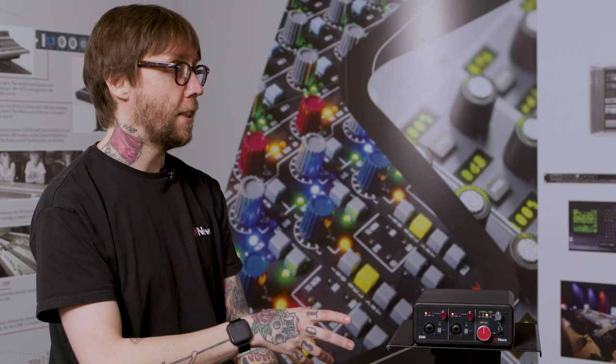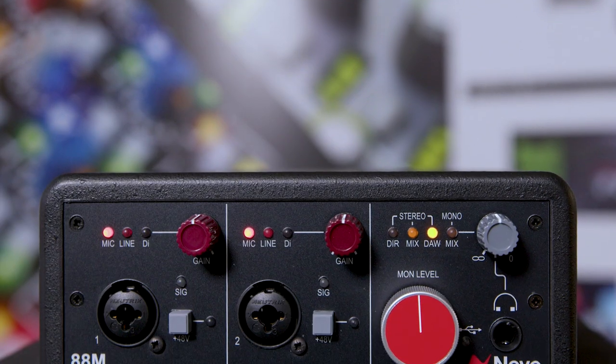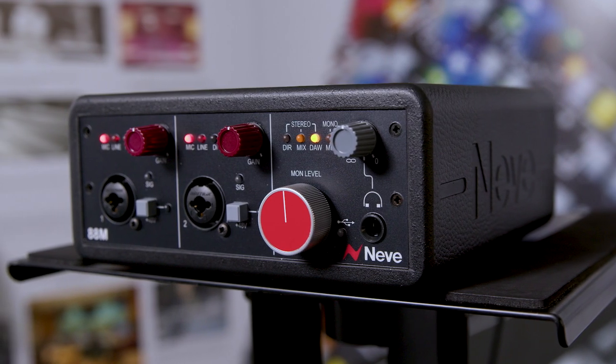You just mentioned the AD797. That's for the preamp gain staging, right? So on the input, we have the transformer balancing that input. Then we have the AD797, which is the premium op amp that's used in the 88 RS console preamp. This, in one single stage, provides the rest of the gain for the preamp circuit itself. And the AD797 itself provides a great bandwidth across the entire range, so more of an open-sounding preamp.